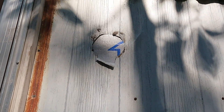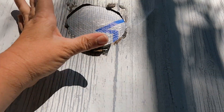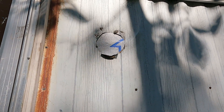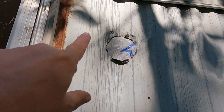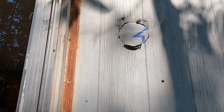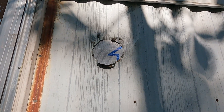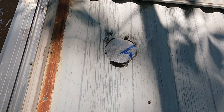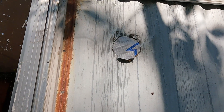On the porch, you can see this is the back porch and part of the metal is peeled away, so I'll have to straighten that out. There is also no support on the inside or the outside — there is just the metal. I don't like that idea; I'd rather have a wooden piece on both sides attached to each other, then caulk all the way around it and put the light up. Re-drill the hole through some wood to make it more stable. It's not that I have a super heavy light, but I still don't like the way that metal looks, so I'd rather have a more secure, waterproof way of installing the light.